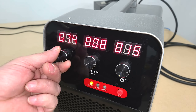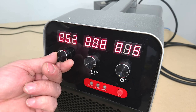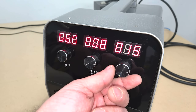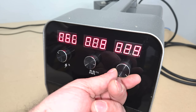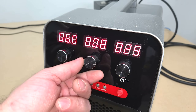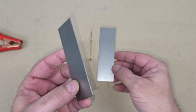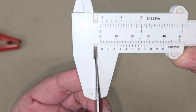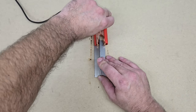It's hard to see the number display in the video for some reason, but the first control on the left is for laser power, which I set to 60% for spot welding 1 millimeter thick carbon steel for the first test. The next control on the right is for adjusting the pulse interval time, which determines the span of time between the start of one pulse to the start of the next pulse, and I set that to 25. The middle control is for adjusting the pulse width, which is the length of time that each pulse will last, and I set that to 15.